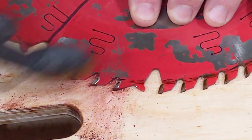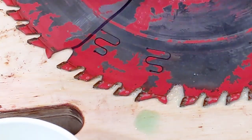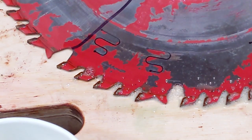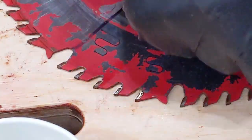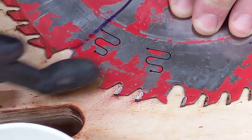Next is simple green. Usually what I'll do is let the entire blade soak overnight in simple green and the pitch comes off easily — the paint comes off easily too. But I wanted to keep the test consistent. So after applying the simple green, I gave it a minute. The paper towel wiped off a little of the pitch, but it still needed some work. The soft bristle brush worked a little better, but ultimately the brass brush was needed to get the job done.